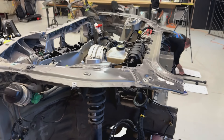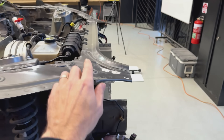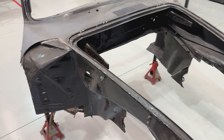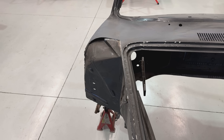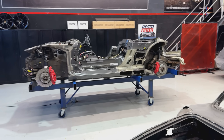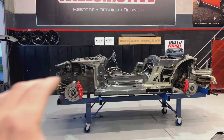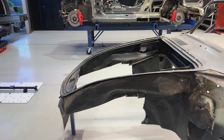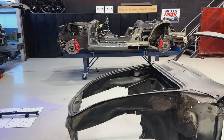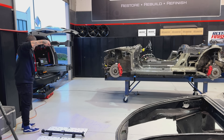We've got a feeling, just by looking at this, that all this area — the top of this strut tower, this brace, all this A-pillar, and even across the front end here — is nowhere near going to fit under the front end of this little 356. The strut tops will be way out under the fenders for sure, with the rough tape measure calculations. The front nose of the 718 is very square across the front, and how flat that comes across, compared to the 356, which is really dropping away fast. So rather than cut and test and refit repeatedly, we're going to go for the 3D scan option.